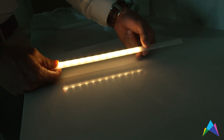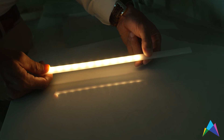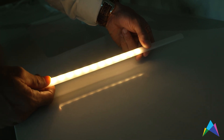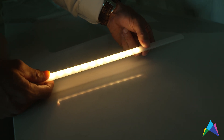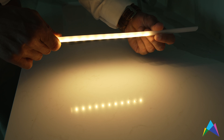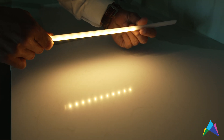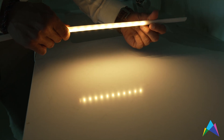Right here you're looking at your average piece of LED tape. This is very inexpensive, but one of the downsides is that it's going to pixelate on your countertop. You can see right through the lens that you're seeing the individual diodes, and if you look into the countertop you see that Christmas tree effect — the pixelization effect — which is not really what you want for your job, as it creates a bit of a tacky feel.